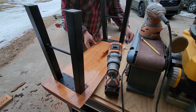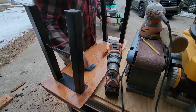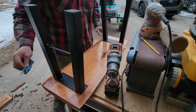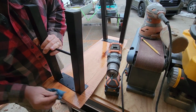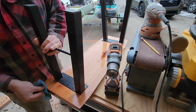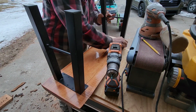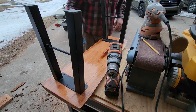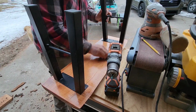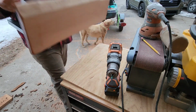There's only 3 ways to get water to go uphill. This is something from Civil Engineering 101 in hydrology. So you have a hydraulic jump. A hydraulic jump is when the water, say, flows down a waterfall, and then you have that water that surges upward at the bottom. Another way is through a pump. You can pump water uphill. And then the third way is through capillary suction. That's the suction transfer of water or liquid through the cells of wood, ground, whatever that may be.